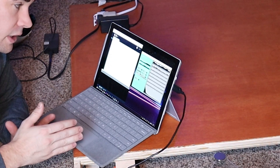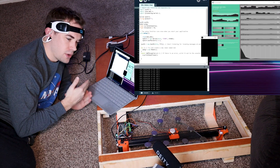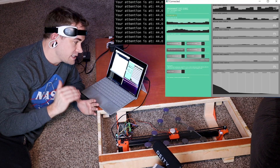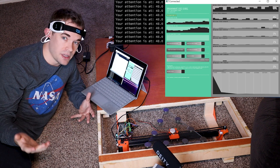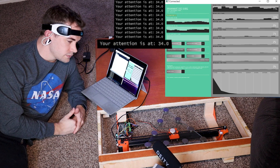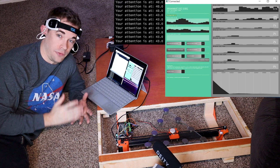Now it's time for me to test this out. I've got one software running to make sure that the headset can connect properly, and now I'm just going to turn the other one on. The table still works. When you first turn on the processing software, it has to connect to the serial port so it resets the Arduino — it's fine. Now that everything's running, I've got the threshold set at 75, so once my attention levels meet that point, it will send a signal through the serial port to the Arduino to send the cups back and forth at whichever speed I pick. Now if I just focus on something, I can see if I can get it to move.